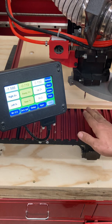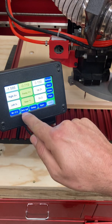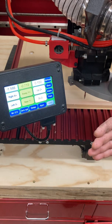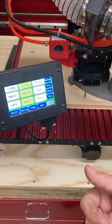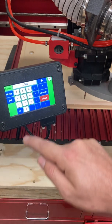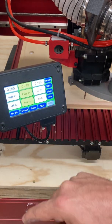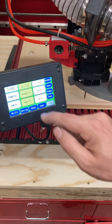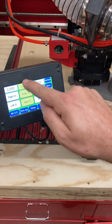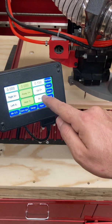Now that my X and Y are lined up as good as I can visually, I'm going to zero each of those. Be careful with the zero XYZ button because it will also zero my Z — and generally speaking I'm going to do that with either the touch plate or manually in a different function. So what I usually end up doing is I go into the DROs for each axis and I set zero. I push in zero and I click set. You always get a warning message because if you do this by accident you can cause a crash later, so the warning message is a good thing. I'm putting in zero for X and Y, and my Z I've previously set using the manual or touch plate method, so I know my Z is correct.